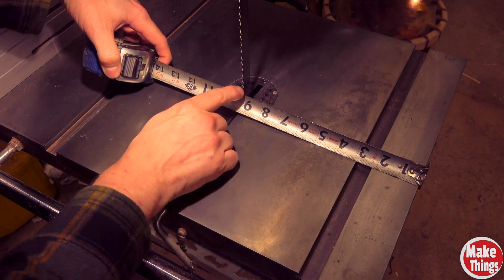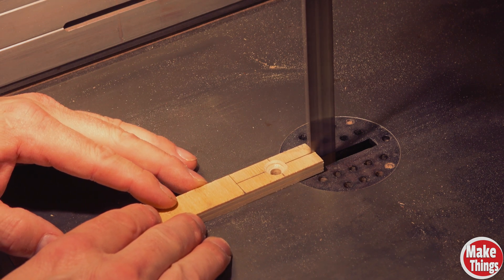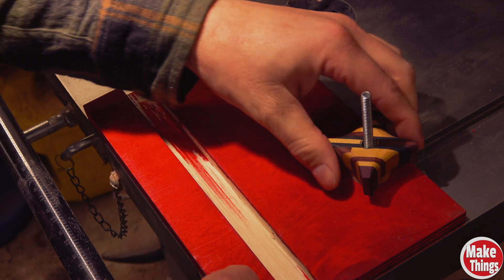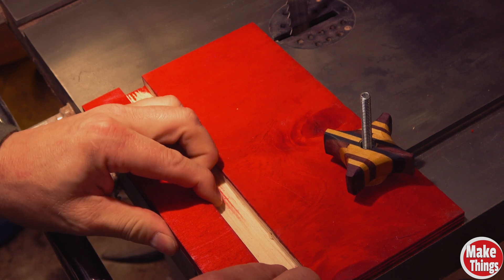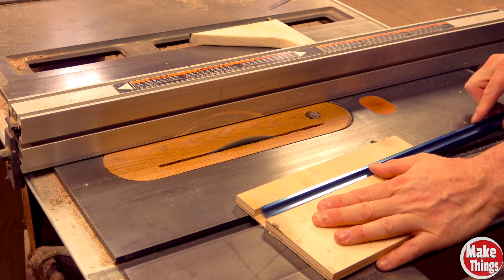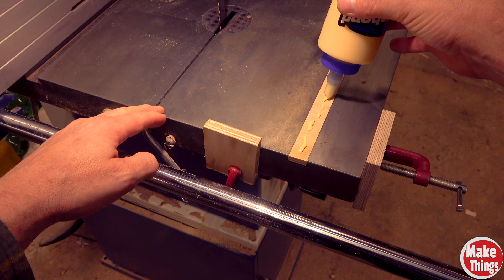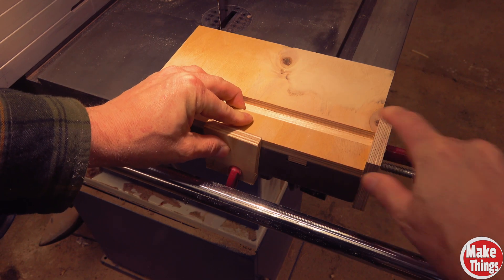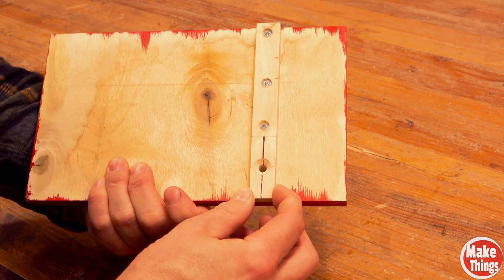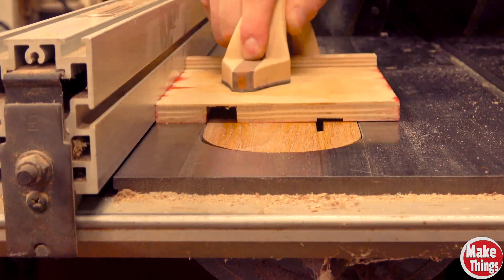The width is the edge past the blade, or 10 inches, and the height is 6 inches. Just like my table saw sled, I'm going to need a miter bar for the miter slot. I have some future jigs that will depend on the sled being locked in the miter slot with the ability to expand and lock with a machine screw. Before attaching the miter bar, I cut a T-track groove which will allow me to attach jigs to the top. With the notch done, I added the expansion bar into the slot, added glue, then the base. To keep it perfectly square to the bandsaw tabletop, I used plywood around the edge and clamped down. I cut the sled to size and nibbled a ruler channel in the base.